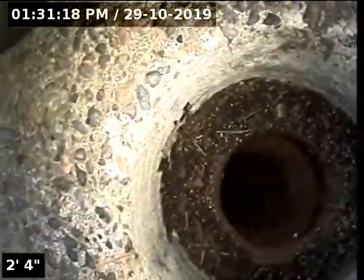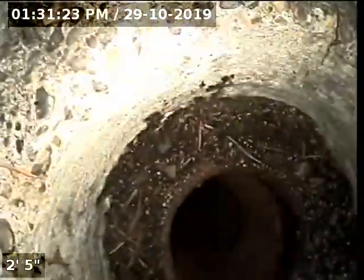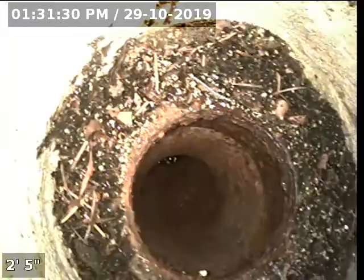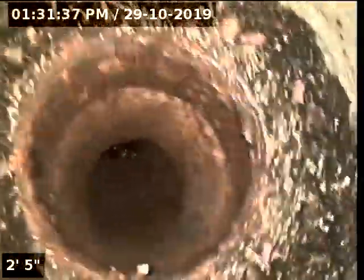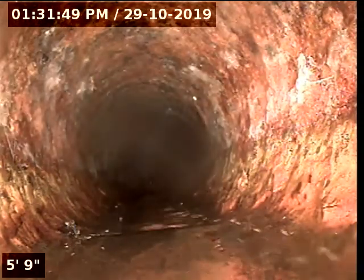I have identified manholes in the street to the south. I'm not seeing any evidence of an easement, so this is going to have to make some turns in order to go in the direction of the lateral. Sometimes that can pose some problems, but we're going to see right now because the lateral is going towards the north.